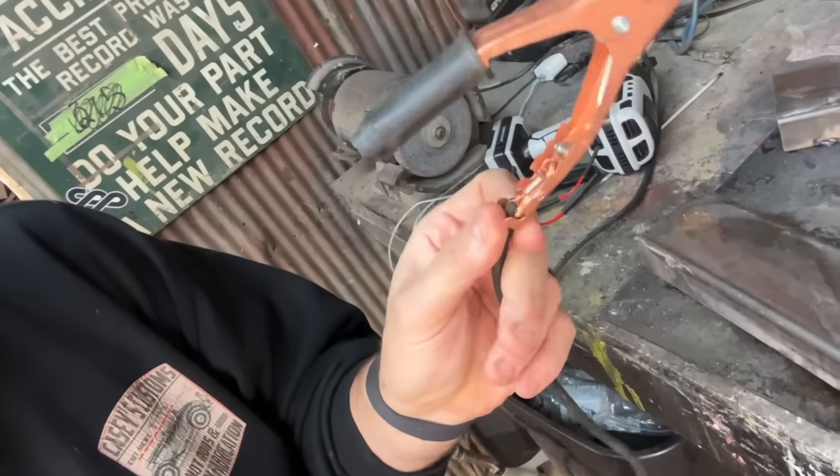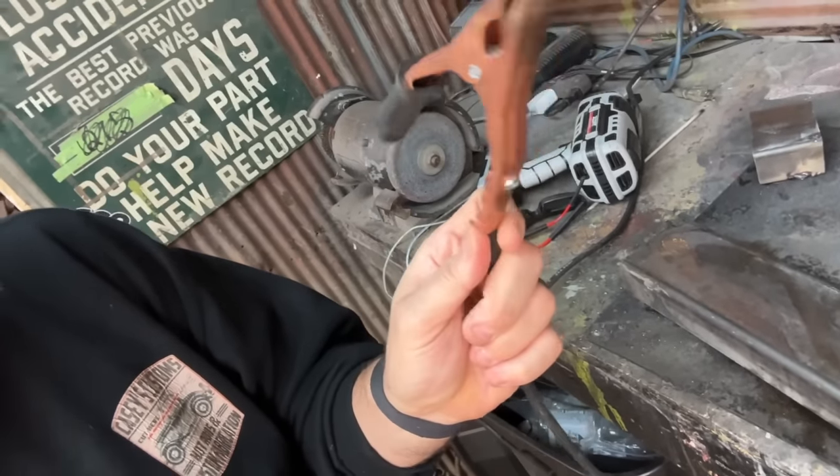So I wanted my dad to try this thing out today. I got him in here hooked up and it basically wouldn't weld at all — he was having all kinds of issues. I said, 'Oh, you just don't know what you're doing,' and then it wouldn't weld for me either. Also when we were welding today it blew the breaker again, and I noticed the ground strap was getting really hot. I came over and looked — that is a tiny ground strap for a stick welder which has quite a lot of amps.